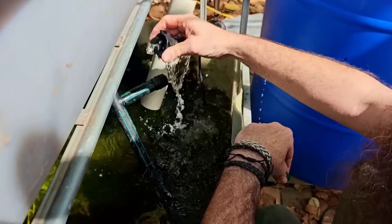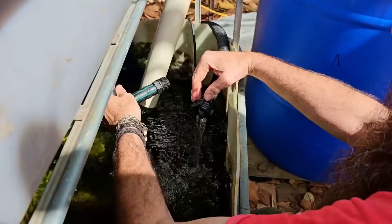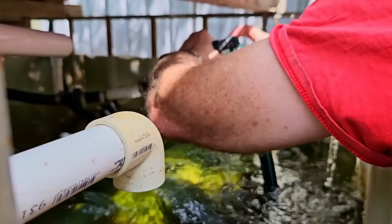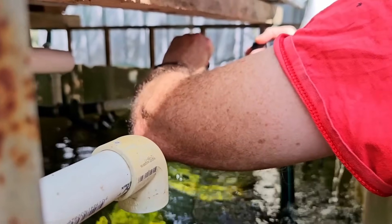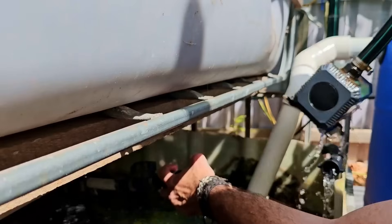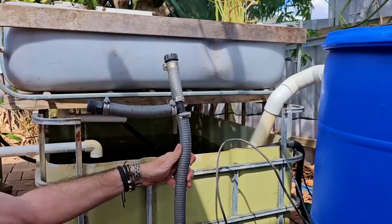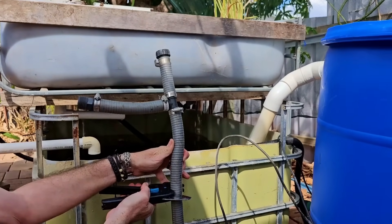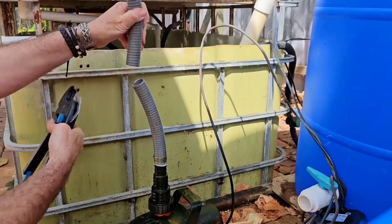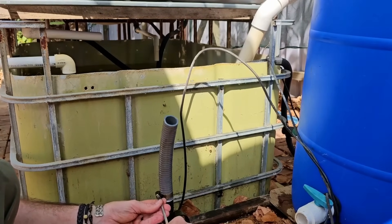Just taking off everything on the existing pump - we're going to have that run back into the sump. It's created a siphon back from the venturi - no drama. This one over the back - I've used an elbow here and there's no washer in there, it must have fallen off while I was putting it in anyway. There's the small little pump that was in there. I've made this a little bit too long - when I made this I copied the lengths from the other system. It actually needs to come down by about half.